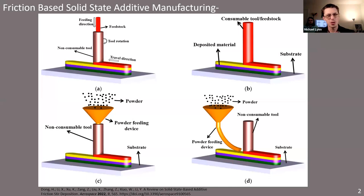There are lots of ways you could go about doing this kind of operation. In industry, it's known as friction-assisted or friction-based solid-state additive manufacturing, which is a mouthful. It basically covers any situation where you aren't directly generating heat by using an electrical resistance heater or a laser to produce a change in the viscosity of a material.